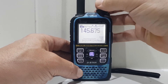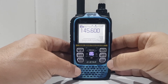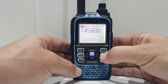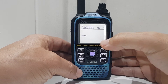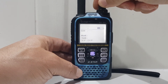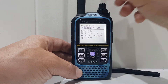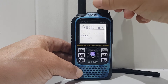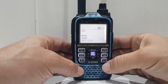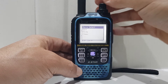Now let's say we want to store GB3WR. We've already got the settings in — get back to the frequency. Hold down this MW button, then turn the knob until you get a blank screen. If it's a blank screen you can add things. If it's full you can edit it, but you're better off looking for a blank screen.